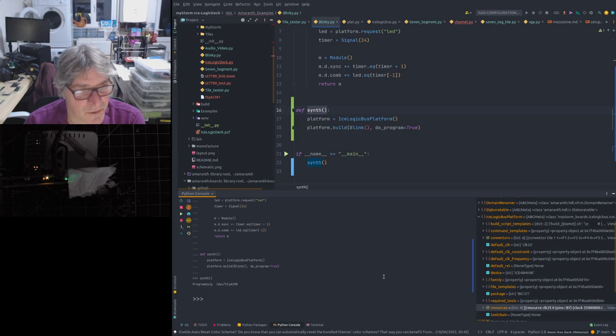But as soon as it's finished programming, assuming we're not sending anything over SPI at this point, in our synthesis, then the CS pin will go high again and the LED will switch off, because the LEDs are active low in this case. We're controlling the cathodes of the LED. That way the green won't be on when we blink the blue LED and it'll be much clearer. So if it then succeeds, what you'll see is just a blue LED going on and off, which would be far more suitable, in my humble opinion.